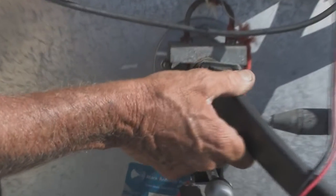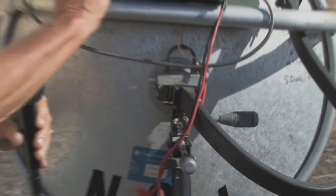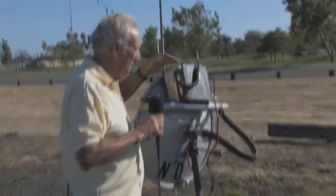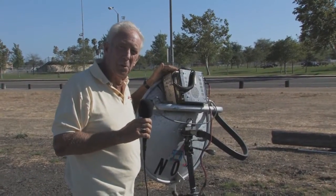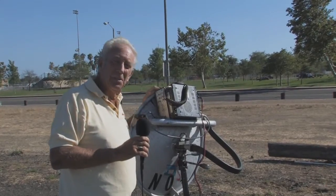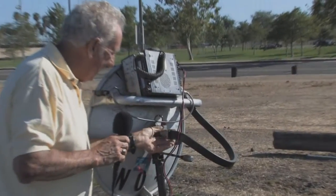The 10,000 megahertz signal comes out of this circular and transforms into flexible waveguide. We can't use coax but rather flexible waveguide to take that signal up to the transverter. The transverter is this green box behind my local oscillator radio. It takes information at 10,368.1 and transforms it down to the 2 meter band. Conversely, when we transmit on 2 meters, it goes into the transverter at about 500 milliwatts and kicks it up to 10,368 megahertz, then out through the flexible waveguide into the dish antenna.